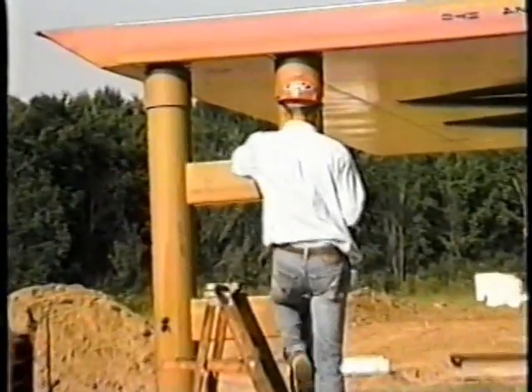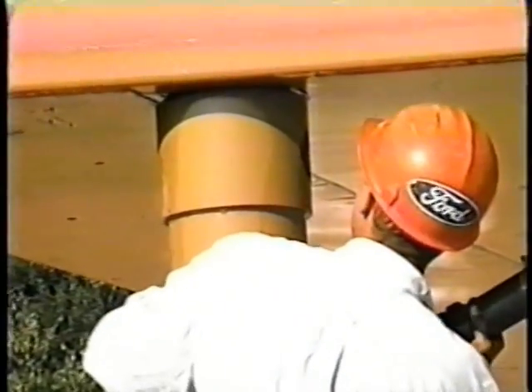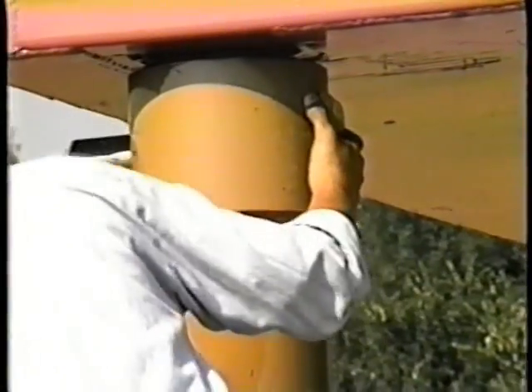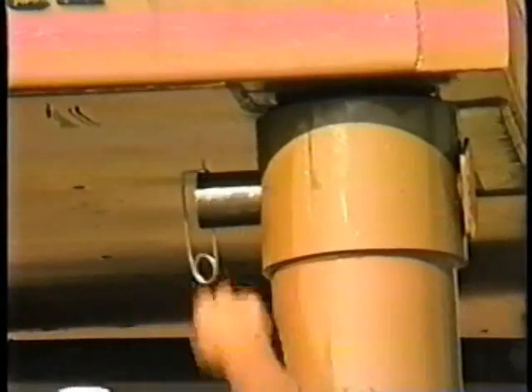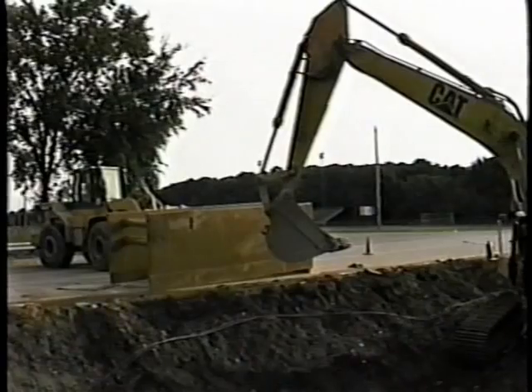A ladder is used to help position the top sidewall collars into the spreader pipe of the bottom sidewall. Place the spreader pins in place and install the keeper pins. The trench shield can now be set upright and is ready to go to work.